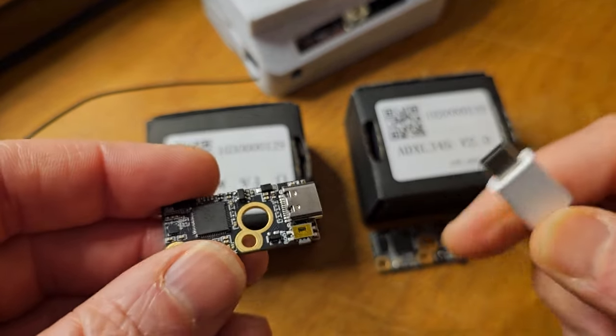Another thing to point out: while it's running through test frequencies, this can help you find loose screws. You might start hearing things rattling and moving around. Do not touch the machine while it's running through these frequencies because you'll upset the natural resonant frequency it's looking for. Just leave it alone and take audible notes of where things are so you can check screws later. But don't touch it while running a test — otherwise you'll get improper feedback and bad numbers.